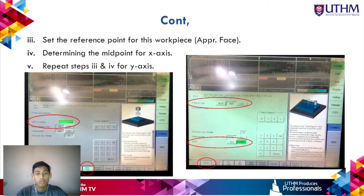Switch the mode to off-mode to touch the opposite surface of the workpiece and press enter to automatically touch the surface. To determine the X-axis midpoint, select the move menu, set the ST menu to off, select the major axis, press the halfway menu, then press enter. Finally, select the coordinate set menu, type G54 on the coordinate system, select the X-axis, ensure the X value is zero, and press enter.